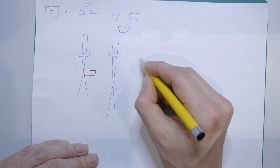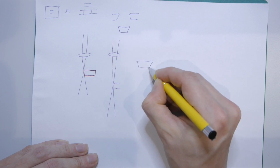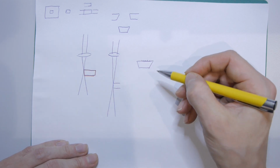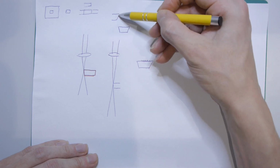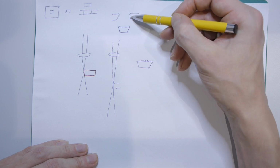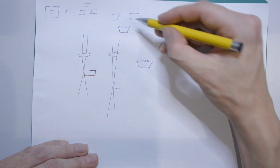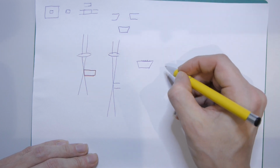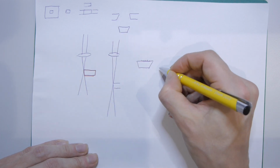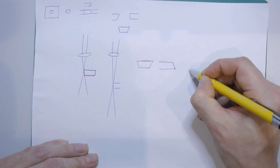When we cut out these pieces, we'll come out with a piece like this here. So like this. And here on the top, there is our engraving. And now we have to change something in the way we cut out the holes for these pieces in our main acrylic board so that they fit to these angles here. And to achieve this, we can turn this around. And when we turn this around and the laser comes from the other side for cutting, then we come out with cutouts that look like this.